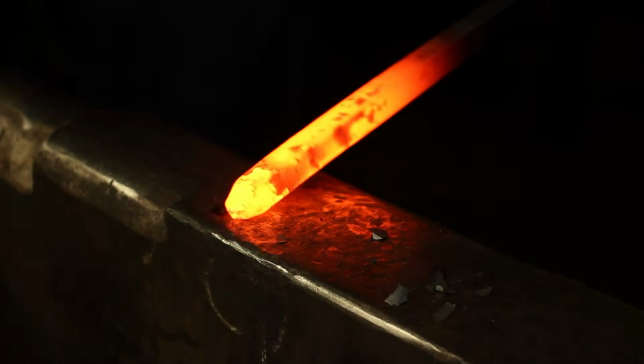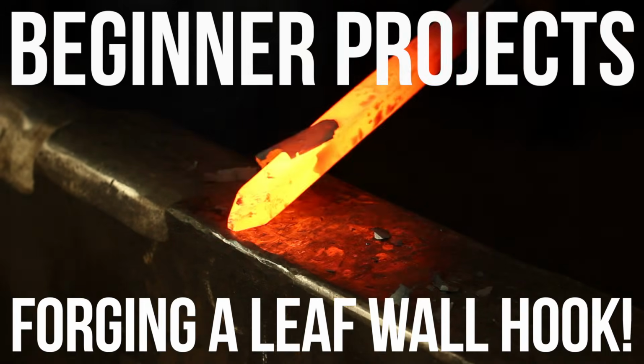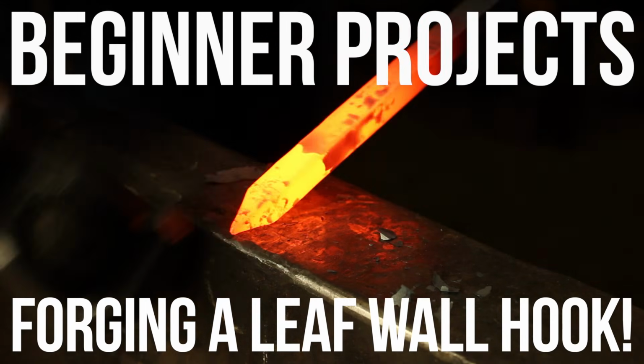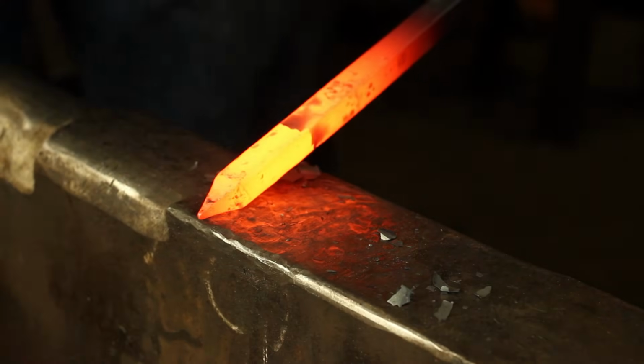So starting off with a 1/2 inch square bar, we're going to start forging half on half off the far edge of the material with our hammer at a nice and steep angle. This will create a very nice short pointy taper.